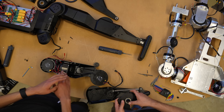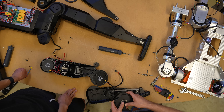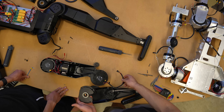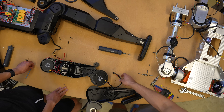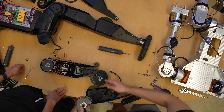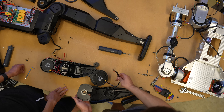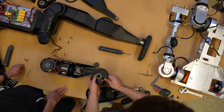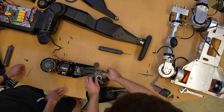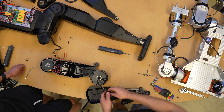These actuators are already being used in industries other than robotics — they're very popular, and that's why the prices can come down. To mitigate issues with radially wired motors having to follow the full range of travel of joints — where there are opportunities for them to strain, pull, and fray — we've been routing a lot of these joints either centrally or through the actual rear bearing of our design, keeping wiring on the center axis and limiting the amount of travel the wiring has to do.